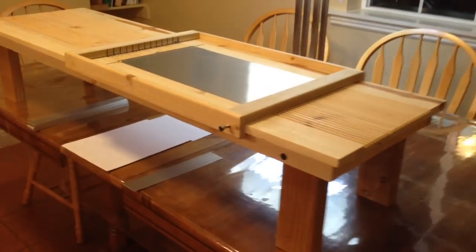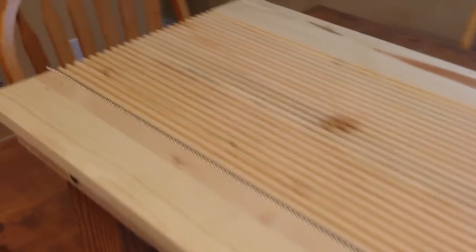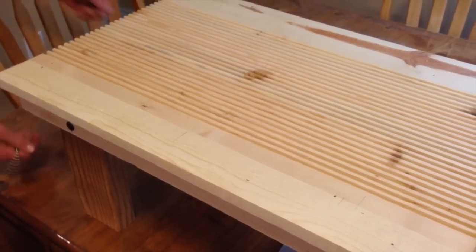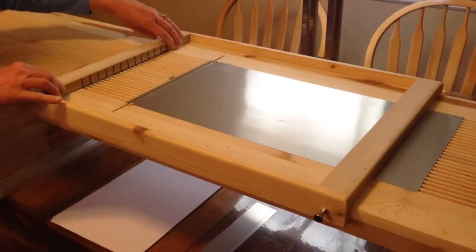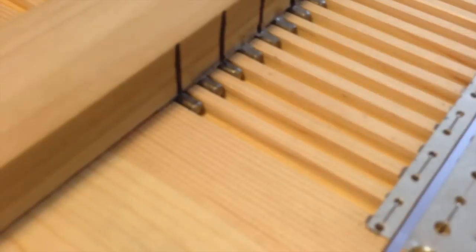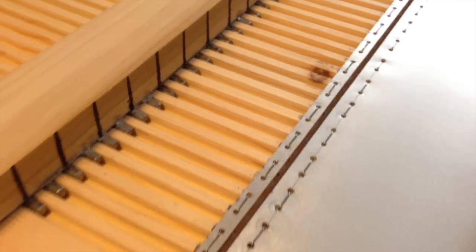My magnet cleaner is a slab of reinforced pine with 25 channels, each holding a chain of 100 magnets. A sliding frame is used to move the magnets into position for cleaning, with 25 steel rods glued to the left side of the frame to draw the magnets along.